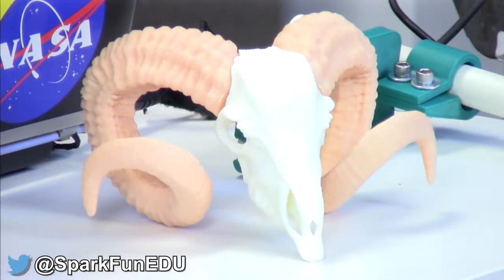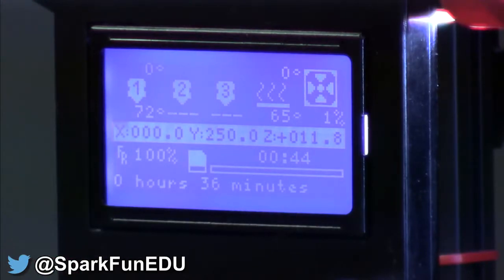Another thing that you can do to make sure that the G-code and the physical material agree most is to make sure that your filament diameter is dialed in, because these are typically sold in thicknesses of like 1.75 millimeter or 3 millimeter nominally. Oftentimes, the filament that you get will range between, say, if you're getting a 3 millimeter filament, you might have 2.88 or 2.91 millimeters, and that tiny variance can actually have a huge effect on the finish of your print. So having that dialed in to what the filament actually is can make better quality prints.